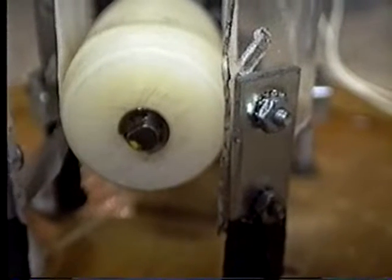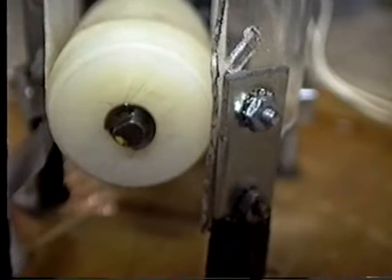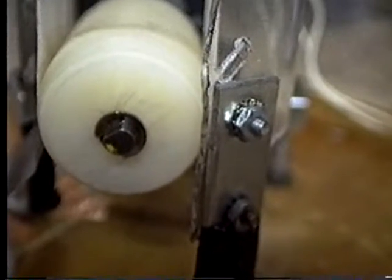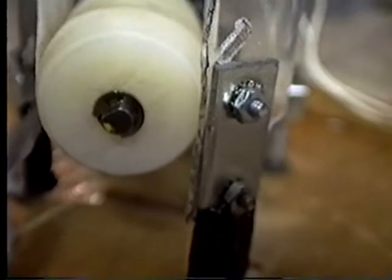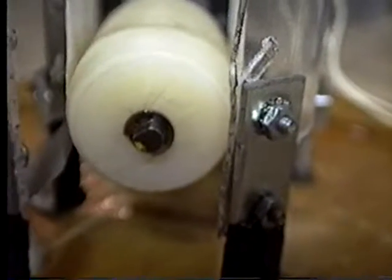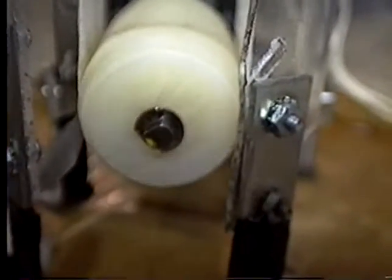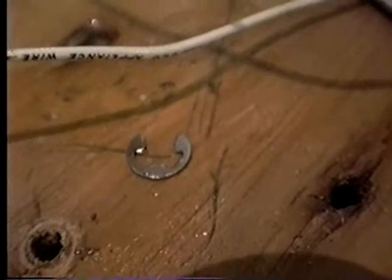We had some keys — I can't even think of the word for them — but we ground a slot with a Dremel and it snap-fits. The block is held in place by drilling a hole in the shaft with a small internal pin. Occasionally it slips out, but it hasn't stopped running yet. You can basically drill a right hole through and use a bolt right through it. All our shafts end with that type of key.